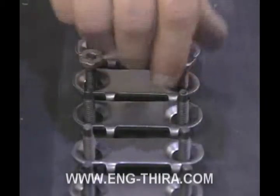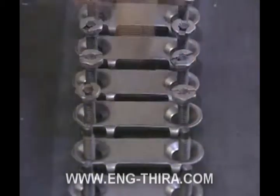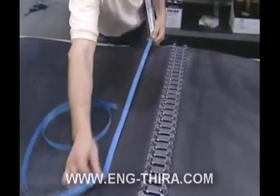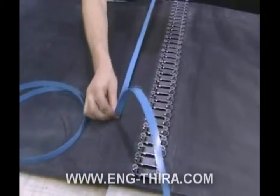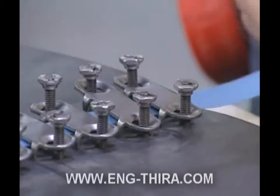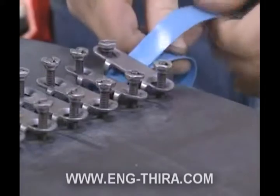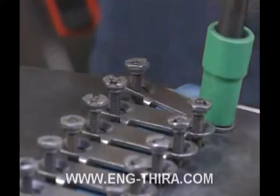Next, start the nuts on the bolts by hand. Note that the bolt solid plate fastener system makes use of Flexco's exclusive piloted bolt assembly for faster installation time. Prior to tightening the nuts on the bolts and before the plate teeth are driven into the belt surface, trim a length of Flexco lock tape to approximately three and a half times the belt width. Next, feed the tape under the top plates, between the bottom plates and the belt surface, and then back under the top plates. Pull the tape tight and hold in position by tightening the nuts on the fastener at each end.